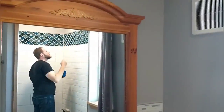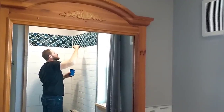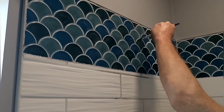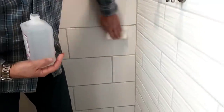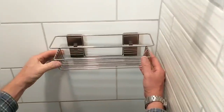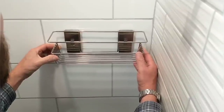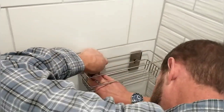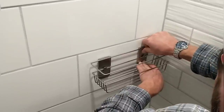The last step to complete the shower was to apply the grout sealer. We really want the grout sealed well, so with a tiny little brush I'm meticulously going over every grout line applying the sealer. We didn't get much video of it but I went over it four times — it took quite a bit of time but we wanted to make sure it was sealed really well. We also needed a place to hold shampoo bottles and soap, so we decided a stick-on rack was the best option. I found a nice convenient location on one of the big tiles, carefully followed the package directions, and it seems to be stuck on really well — a good sturdy rack.